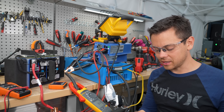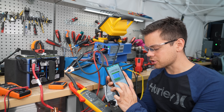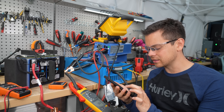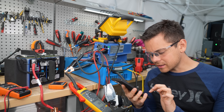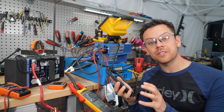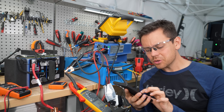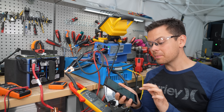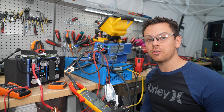Let's check their website. It says overcurrent protection, but there's inconsistent advertising — one image says 6,000 cycles and scrolling down it says 5,000 cycles. Their website states the max continuous discharge current is 150 amps and the max discharge current for five seconds is 600 amps. That's why it was able to lift the car. Maybe it is rated correctly — 200 amps is pretty close to the 150 amp continuous max, and all the hardware seemed to handle that current just fine.